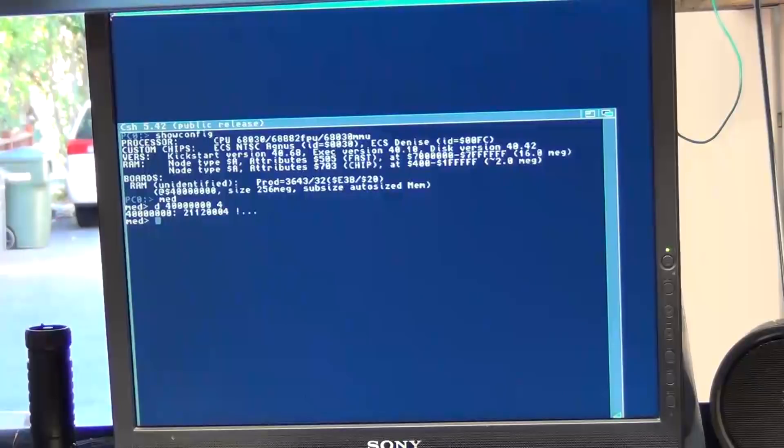Since the Amiga didn't actually end up using or mapping in this memory, we can feel free to read and write values there. The first thing I'm going to do is try to write all zeros to see if we've got any stuck ones. We'll read it back — and we see it's all zeros, so that seemed to work. Let's try writing all ones. That was not so successful — it seems like some nibbles were written successfully, but others were not.